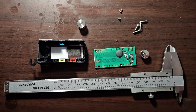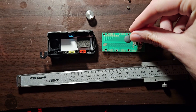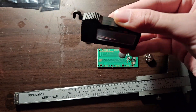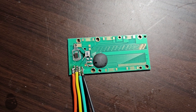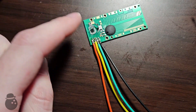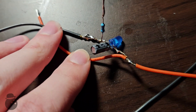For filament measurement, let's take apart a set of calipers. Digital calipers work by reading the movement of a printed circuit board as it is pulled along with the opening and closing of the jaws. The board converts that movement into digital signals, which are output to a display. Traditionally, digital calipers have a battery and are entirely self-contained. There are, however, four pads which can provide power and output the digital signal from and to an outside source. In my case, the green and yellow wires provide the signal, and the red and black wires provide power. The resistors, capacitor, and LED in the power chain regulate the input power and ensure the calipers get what they need.